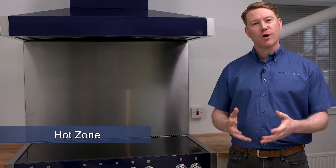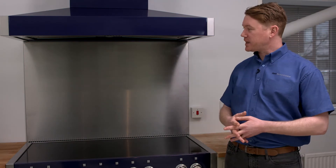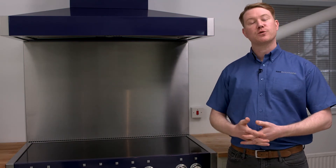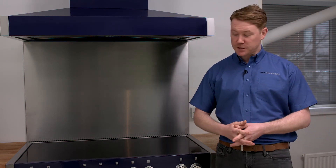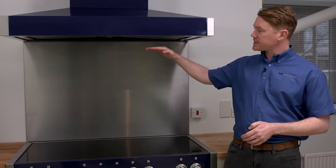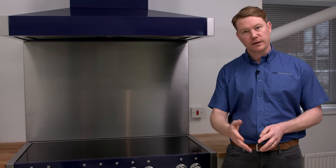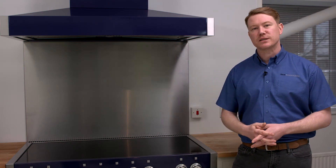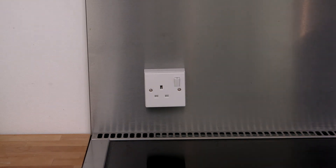Check two: hot zone. This is an area at the rear of the cooker which must be kept free from any surface fittings or furniture such as isolation switches and plug sockets. The area must be the full width of the cooker and a minimum of 650 millimeters above hob level, depending on your model — please see installation instructions for guidance. Plug sockets like this are in an unacceptable position and would need to be moved by a competent electrician.